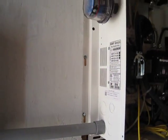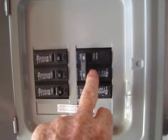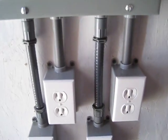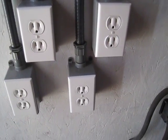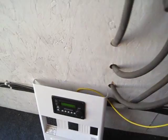Got this all hooked up and we came off the side of the inverter. Got the sub panel hooked up. Got it coming in to a 40 amp main instead of a 60 like it calls for, and we got four breakers here — accessories — and got outlets right down below it. I just put these down here to make it a lot easier to do what I want to do with everything. Still got to move this one big heavy cable that's right here on the inverter — it's got to go behind the back of these wires so the cover can go on, but I've got it powered up.